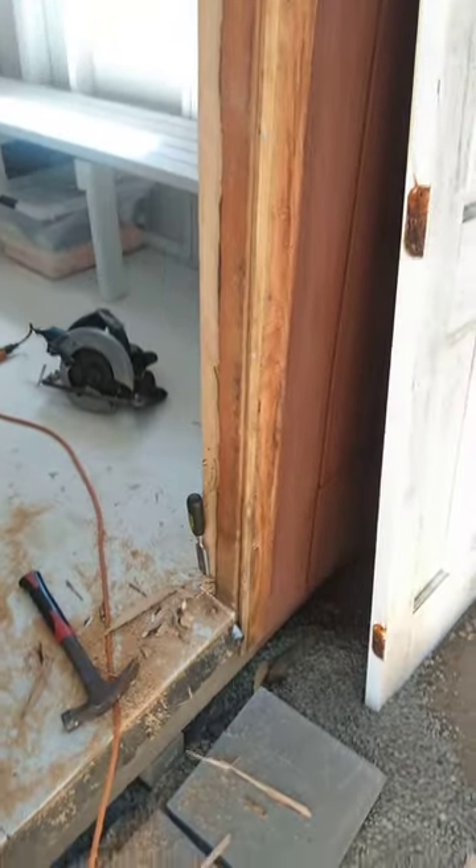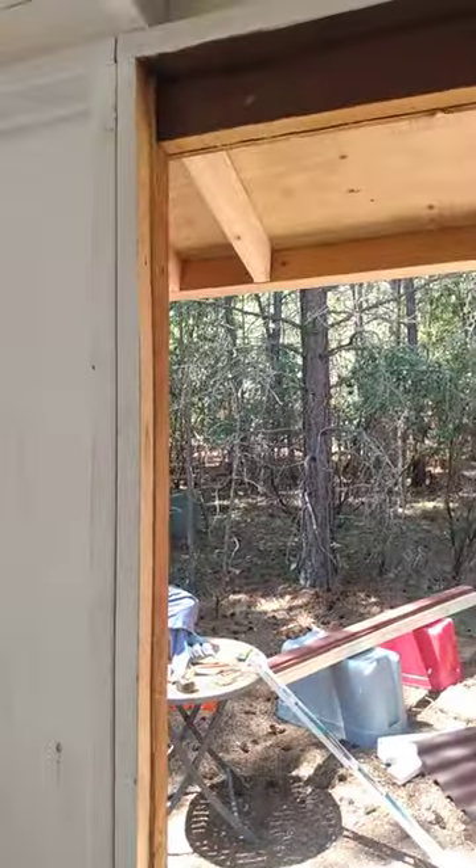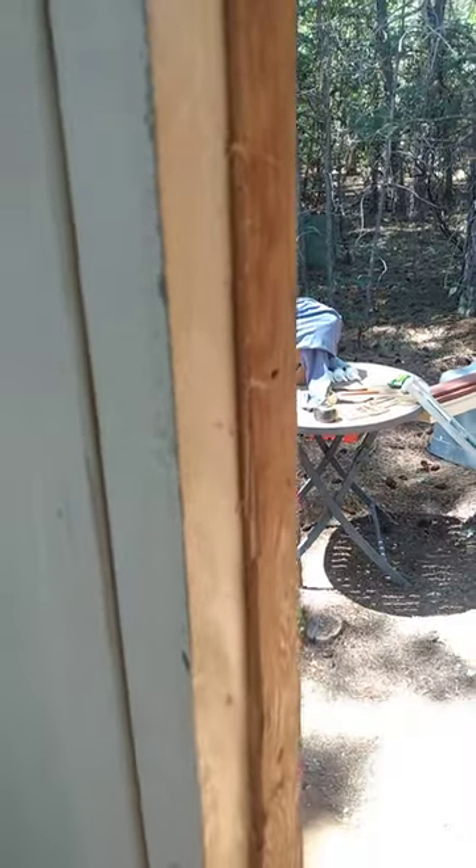That's Fathead Thor. The door is a little wide — it's from a closet, obviously in a bigger house. This is a tiny house and I had to cut the door jamb back with the saw, chiseling out the last bottom half, just to widen it because the door is a little wider than this opening — 24 and a quarter.